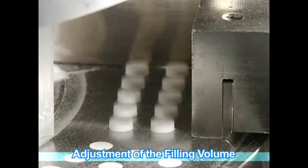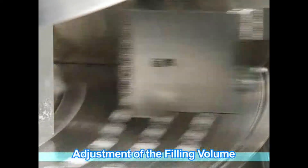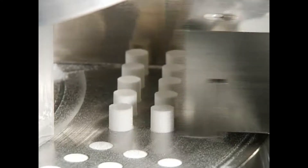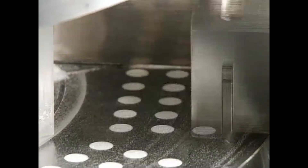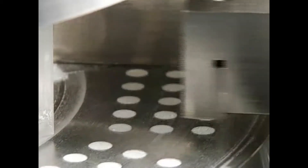The body is directly filled by the mechanical vibrator method and pressure is applied to maintain a constant density. The preset volume is raised from below, the excess powder wiped away and after volume adjustment, the capsule halves are joined. For die compression filling, granule filling and liquid filling, the capsule body is filled after volume adjustments.